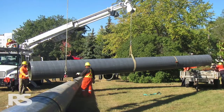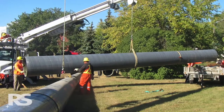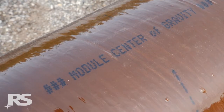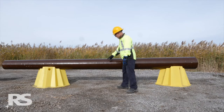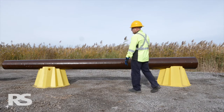For larger and heavier modules, use a boom truck with a sling attached at the center of gravity. The COG is printed on each module prior to shipping. However, be careful as the top module is often cut to length, so the COG marking will not be correct and the COG should be established prior to handling.